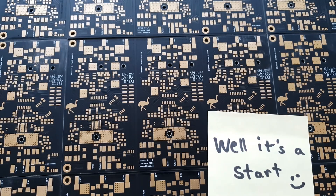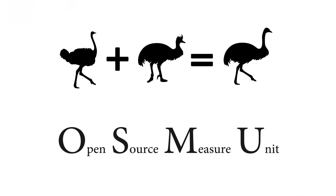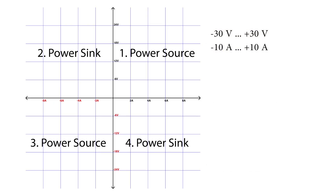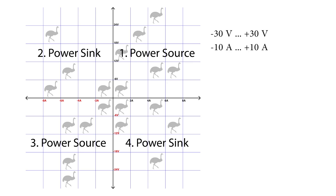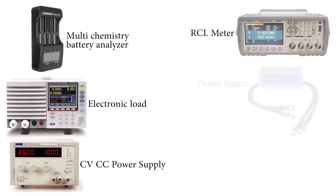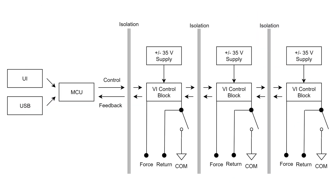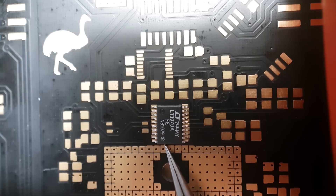Those features will be in my own power supply though, that's for sure. This is the OSMU — my most ambitious project yet. OSMU is short for Open Source Measure Unit. I'm not trying to make another pico ampere resolution device; instead it'll be a general purpose medium power four-quadrant supply, meaning that it can put out voltages between plus and minus 30 volt while sourcing or sinking currents up to 10 ampere. Simple so far, but already such a device has a ton of cool functions. Now what if I managed to put three isolated channels onto one side of a small circuit board?